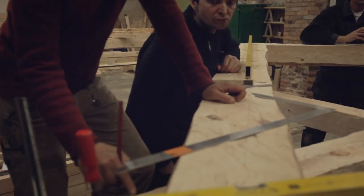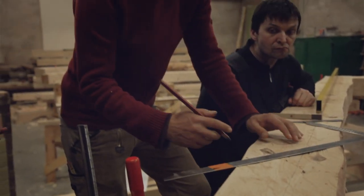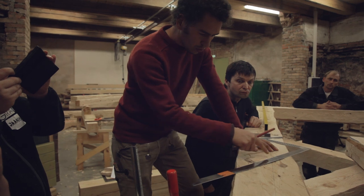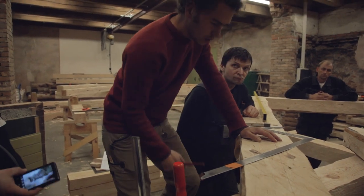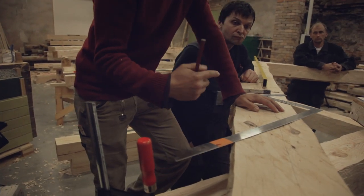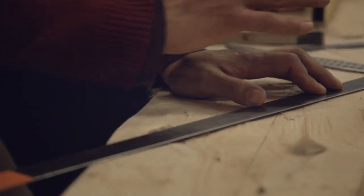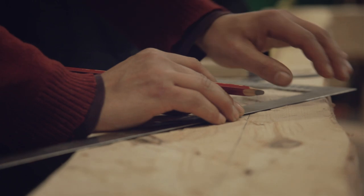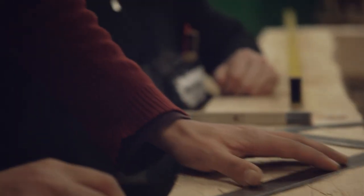This is this corner, so we will go deeper until here and join here. What we want is to report this on this wood and also on the underface and also here. So I will make lines and extend them in order to report with the plumb on the other sides. Here I can join from here to here, but as we saw before, maybe this point is not at the vertical of the other corner. So I have to choose a cut to do, it's me who chooses.